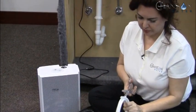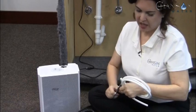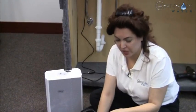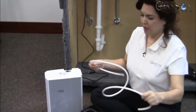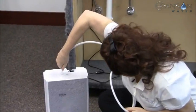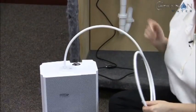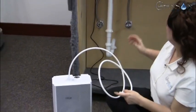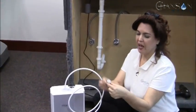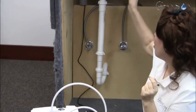I'm going to cut the tubing. Anytime you use scissors on your tubing, you want to make sure you're making very clean cuts and that your cuts are not folding the tubing. Right now I'm just cutting the zip ties that hold it. We use quick connect fittings that are very easy to use — I'm going to press this straight down into the ionizer, and you'll see that I cannot pull it out. It is secure. This is a three-eighths inch quick connect fitting.